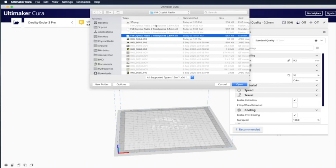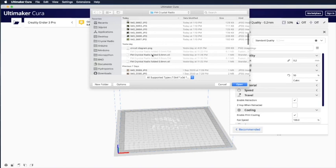This is the original design, using 2 fixed plates held together by screws. I find it looks nicer, looks better. However, the Q factor is a bit lower than this new design, which is using a single plate of copper that we fold in half to create the variable capacitor. Again, we have a 0.5 millimeter version and 0.8 millimeter version.